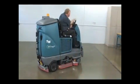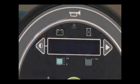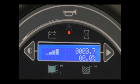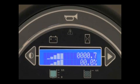The steering wheel controls the machine travel path. Most of the scrubbing functions are controlled by the operator using the control module in the center of the steering wheel. The horn is controlled by a half ring button at the top of the control module. Pressing anywhere on the button will sound the horn. In the center, below the horn ring, is a warning indicator. In certain conditions, the warning indicator will turn on and a message that describes the condition will be displayed in the window below the indicator. You may be required to stop the machine and follow your company's service procedure guidelines to correct the condition. This display window is also used to indicate the battery charge level, hour meter reading, the solution level, and the recovery tank level.